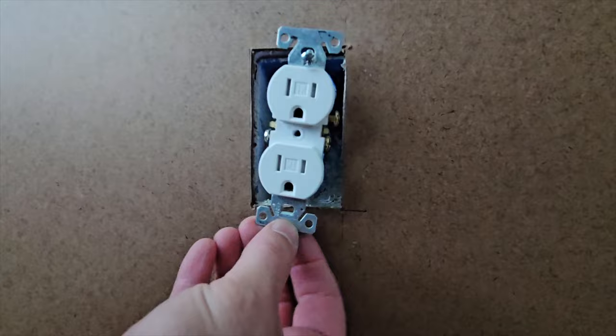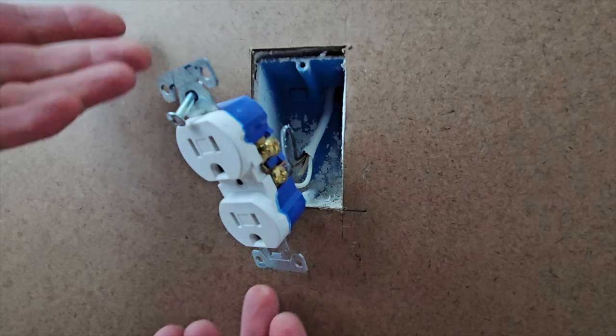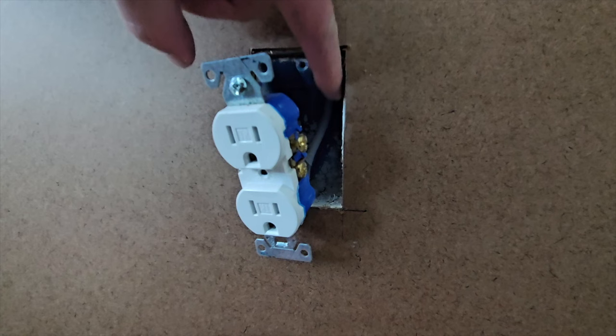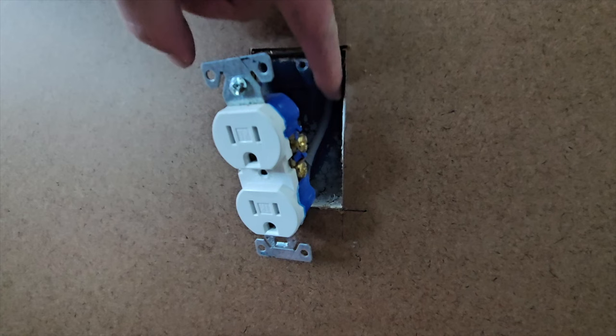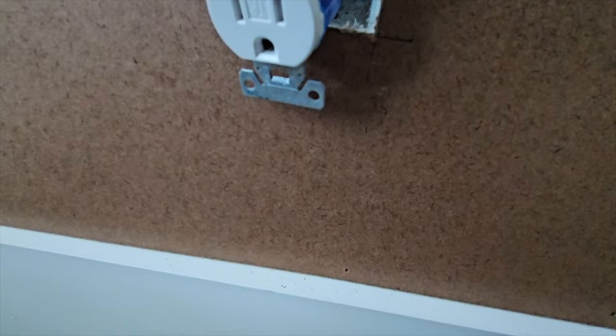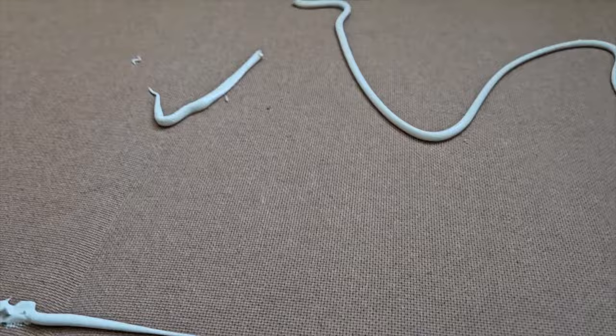One key thing with this project is to remember the electrical boxes. Make sure the circuit breaker is turned off before working around outlets. The panel cutout needs to mount flush with the electrical box behind it. Measure from the corner where you start the panel, and measure up from the baseboard to locate the electrical box, so that the exterior of the outlet plug sits flush against the exterior of the panel.